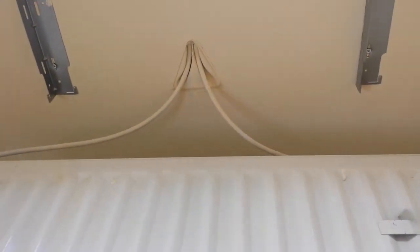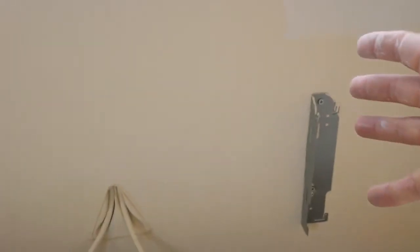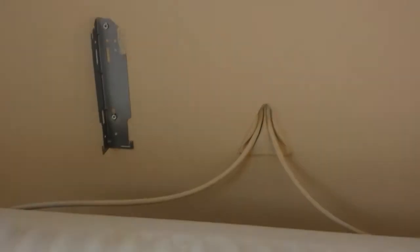But if you have a newer house, generally nowadays you get these flexible pipes — they're plastic rather than copper. So what you do is you just lift the radiator up, whip it off the wall, but put a pot down roughly the height of underneath one of these brackets. You need to rest it on there, otherwise you might pull out one of the pipes from the joints.